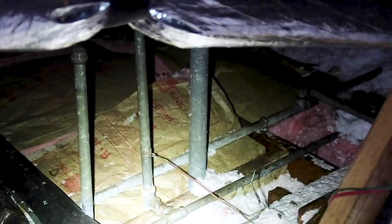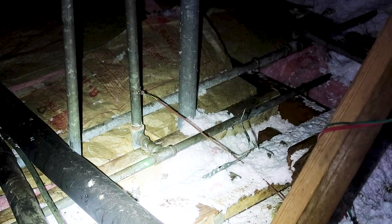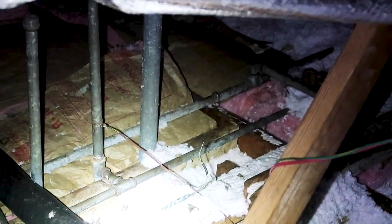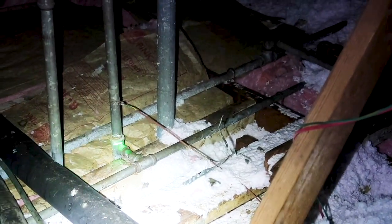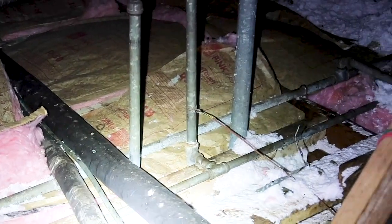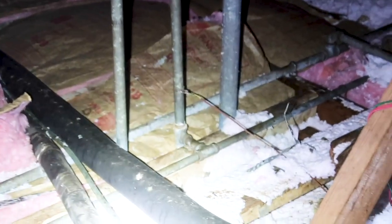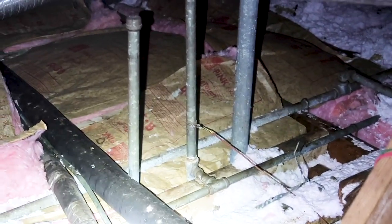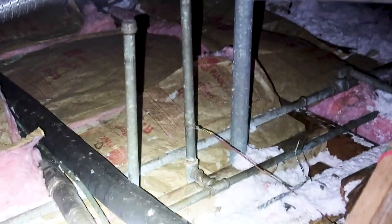You want to look for leaks on the galvanized water lines. You can see the water stains around the pipe, and the rust and corrosion on the pipe. This is an easy spot to call out, and they would probably just want to budget to come in and replace these — for negotiating power or so they understand what they're purchasing and know this is something that'll need to be tackled down the line.